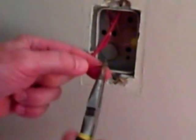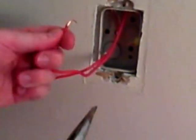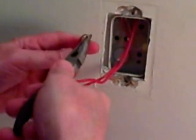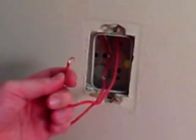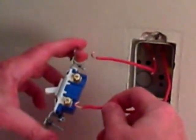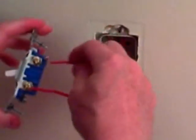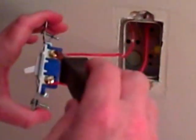We'll do that on both wires, then give them a little hook shape with a pair of needle-nose pliers. We're going to shape it like that, and that's going to go around the terminal and give a great connection. I have a nice hook on the end of each wire, and I'm going to wrap it around the terminal in a clockwise direction so that as we tighten down the terminal, it tightens down on the wire.